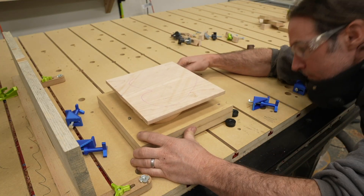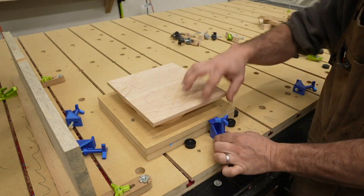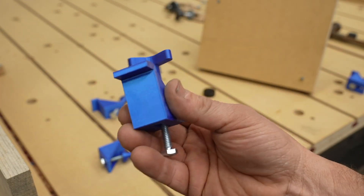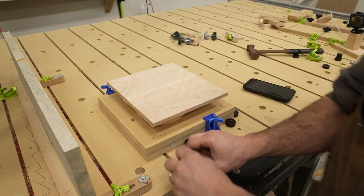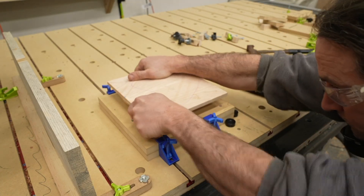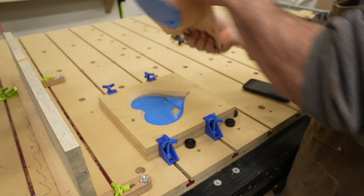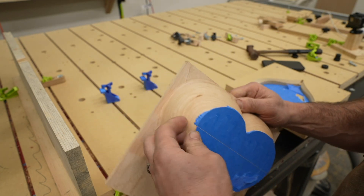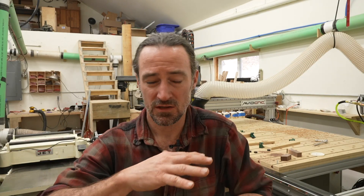I'm holding the jig to the table with some 3D-printed hold-downs, and these work great. I designed them parametrically, meaning I can print them at any particular height, size, and length I need. Check the link in the description if you want to make some yourself. I did a pull-out test to see if it would hold down well enough, and the CA glue pulled right out. Part of the problem was the jig wasn't letting the bottom of the box sit down far enough, so it wasn't getting enough contact with the tape. I solved this by planing off a little bit at the bottom of the jig so it would sit a little higher, creating a gap that allowed really tight contact between the two pieces.